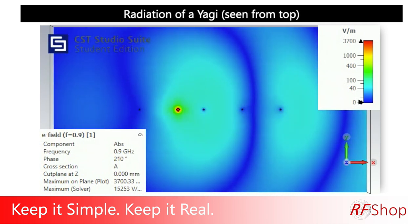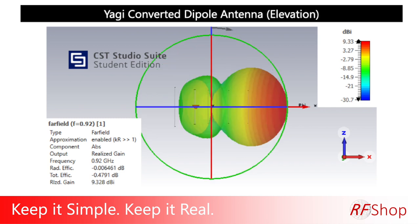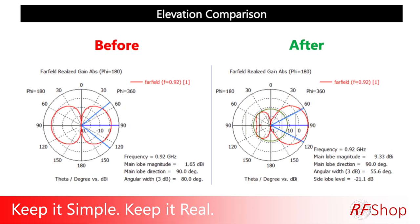You may see three-dimensional plots on data sheets — I have it on screen. The problem with 3D plots is that if you look at them on a two-dimensional print, you struggle to visualize them. I'm showing what we call azimuth and elevation. Azimuth means looking from the top, so you can see how it radiates all around; from the side, it has a bubble effect in all directions. Conversely, the directional antenna we're creating pushes all the energy in one forward direction, whether viewed from the side or top.